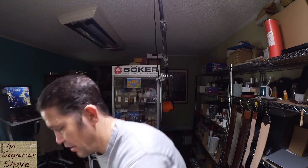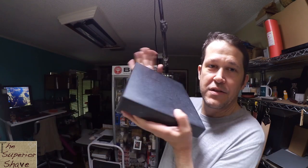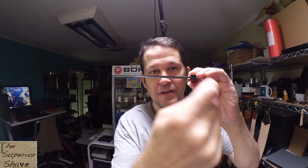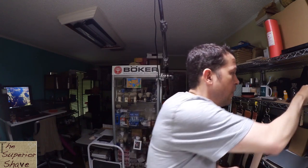I'm going to show you the clip from yesterday with my grade B surface plate. It's only grade B, but it is granite and it is a surface plate, and it has only been used to hold sandpaper, things like that. Grade B as a surface plate is still very damn flat, and I would argue much flatter than the average razor out there. I'm not going to show you a razor that would shine light on the granite plate — maybe one day — but this razor will definitely show you light coming from the center, because in the middle it's curving toward the show side, and quite a bit too.